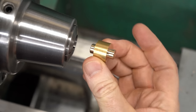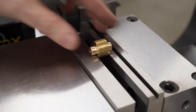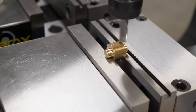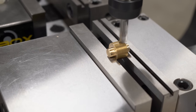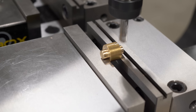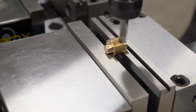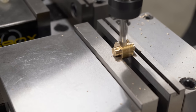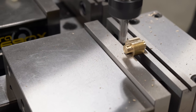That fits just as well as the first side did. While we could finish this part here on the lathe, I'm too lazy to swap out the chuck, so let's just take this over to the mill. The nut needs flats milled on the top and on the bottom. There's no orientation yet so we can just put it in any way we like as long as it's level front to back, then touch off with the tool to establish a zero. Once we've found the zero point I'll put that in the DRO and raise the knee the amount we need to take off in a couple of passes. In a soft material like brass with a sharp end mill, there's no reason you couldn't go directly to final depth, but I always like to take a shallow pass last for the best surface finish possible.